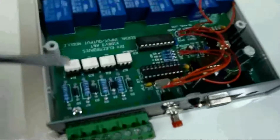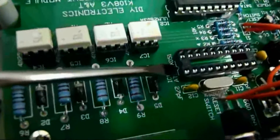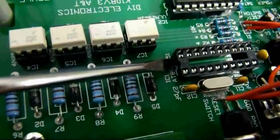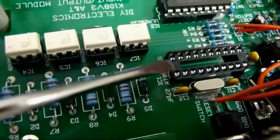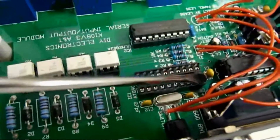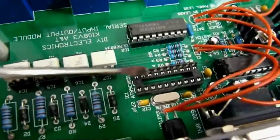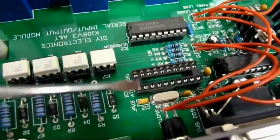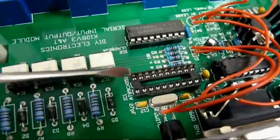Let's put that to the side. On your K108 box there's a little notch, and as you know from an IC chip, this pin right here will be pin number 1. Then 1, 2, 3, and so on — pin 10, 11, 12, 13, 14, 15, all the way up to pin 20. So: pin 1, pin 10, pin 11, pin 20.